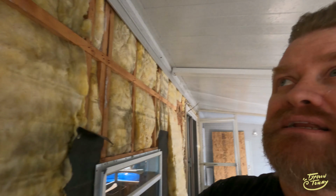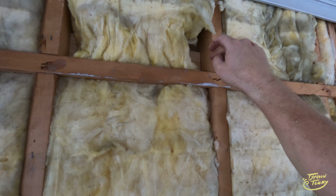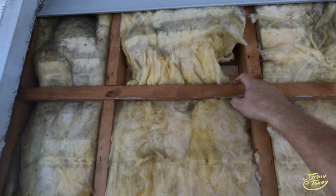All right, well, that all worked out really well. One of the added bonuses was when I took out the shelving unit on the inside, I still had the one that the microwave was attached to, and it was mainly attached to that other cabinet. So when I took it off, it was kind of floating. I threw some screws in, but they just went through drywall because it didn't come in contact with a stud anywhere along its plane. So I added an extra piece of wood here that I nailed into the studs, and now it has its screws coming in through from the microwave cabinet.